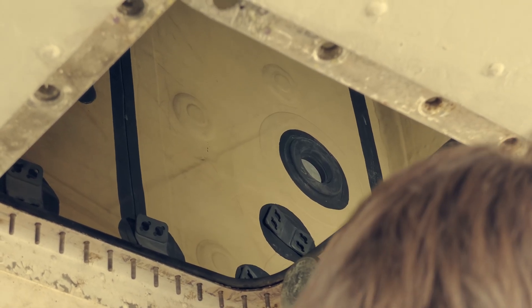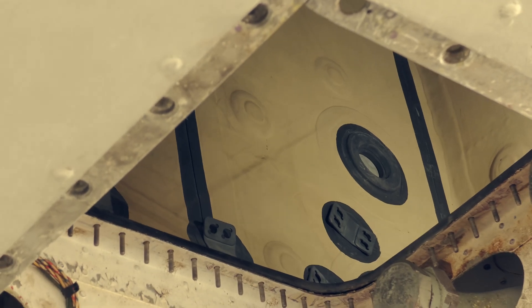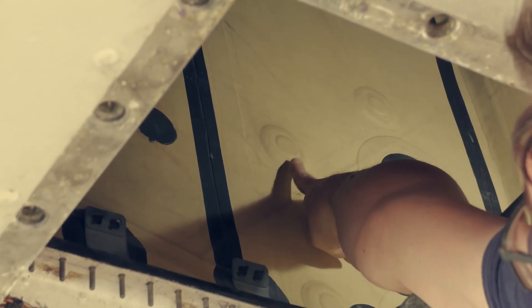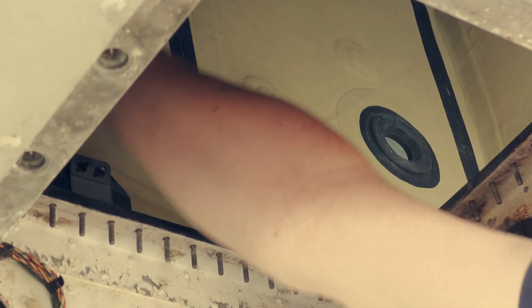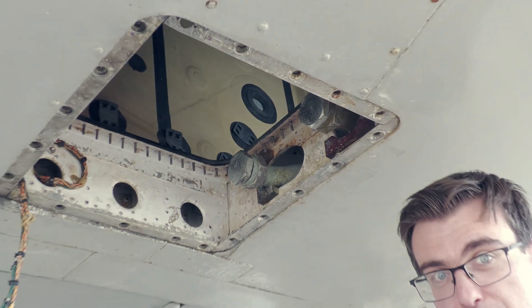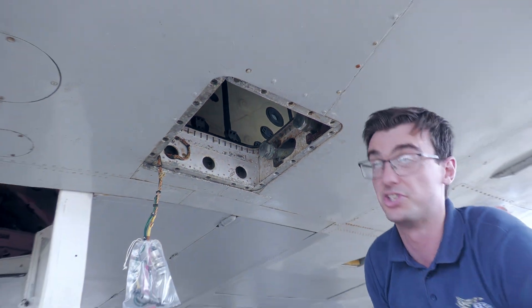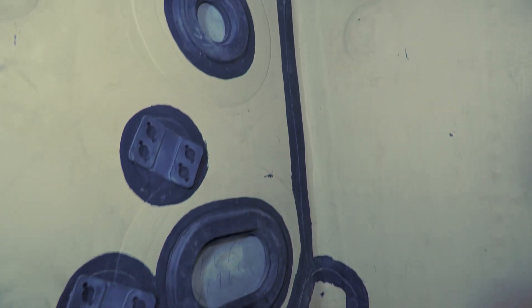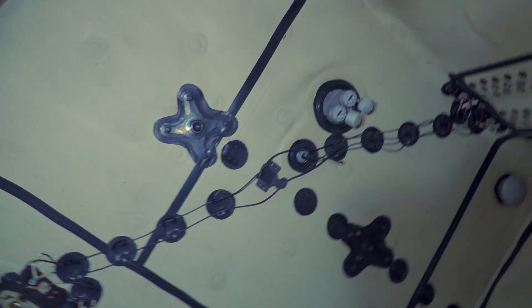There are little poppers that have holes in the airframe — you can just see one there, dotted all around the tank. When you're inside the tank you have to locate them, push them out, and pop them in, and that secures the bag all the way around the skin of the tank. This is inside number two fuel tank, which is rather cool.